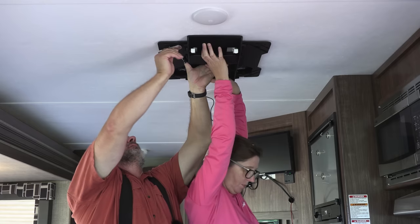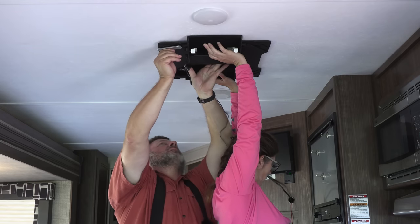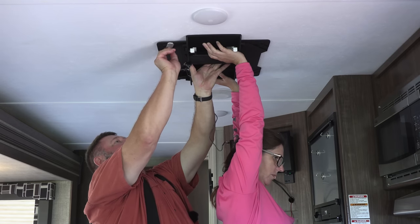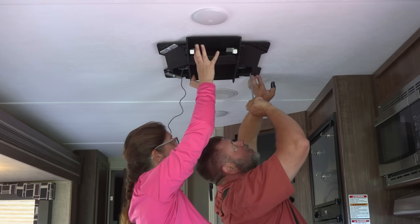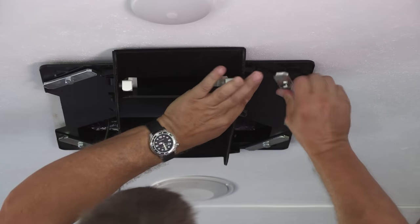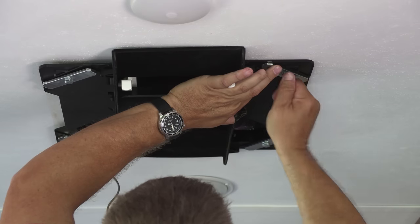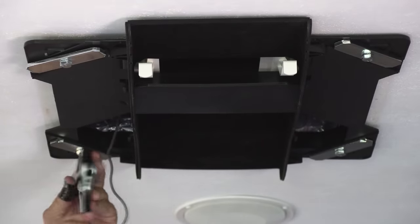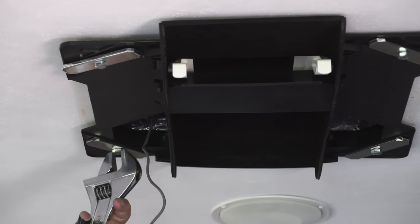Hitting that hole is going to be the hardest thing. Wandering around, seeing as I turn the nut or bolt if it feels like it fell in the hole. So when we tighten these up, we're going to tighten them snug on each one. Just kind of go back and forth. We're going to go over this side, snug this one up, and then we'll tighten them up after we snug them all up. We don't want to tighten one side all the way down because it'll push the gasket out.